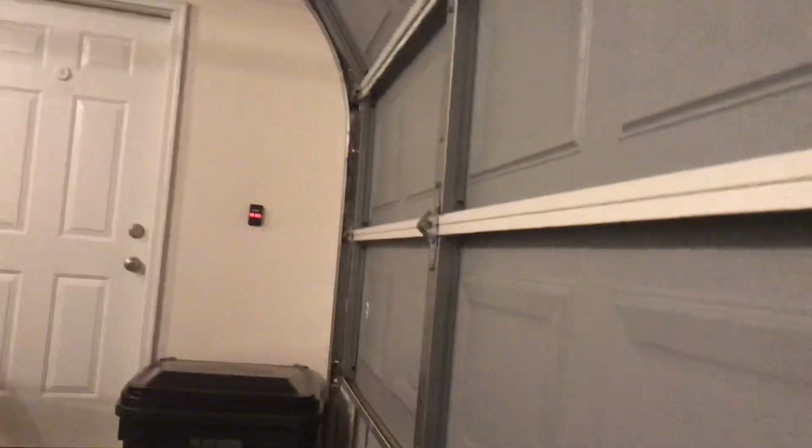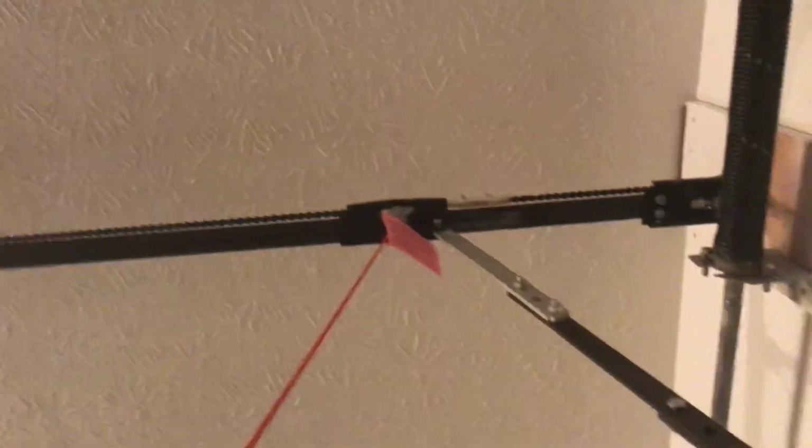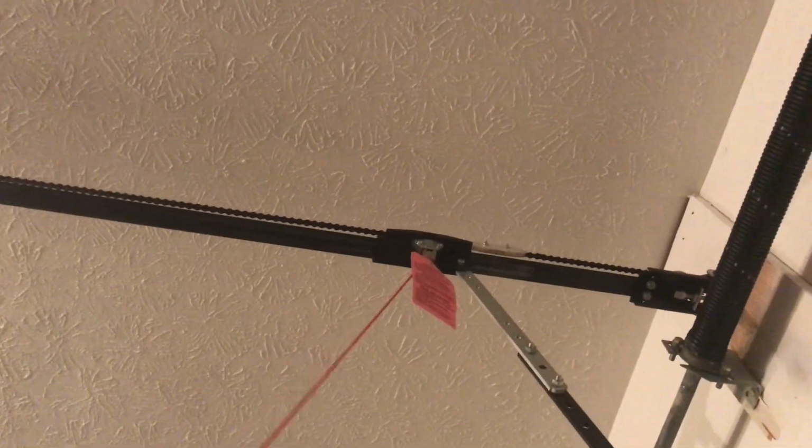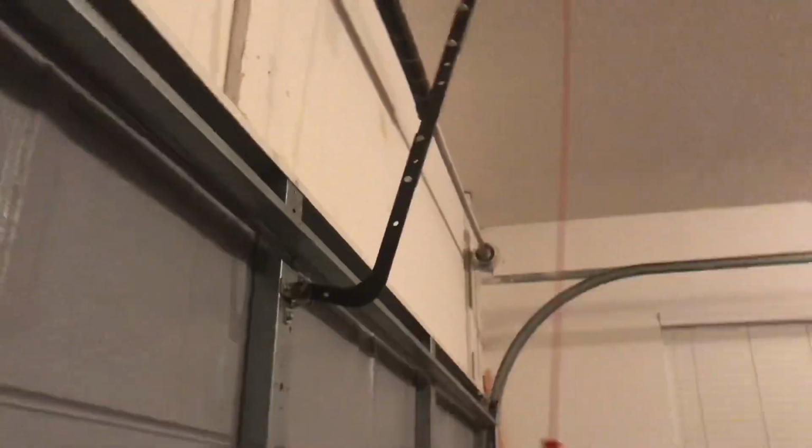You can see this door is fairly balanced. So to reconnect it, you just go over and hit the button. But if you want to have it disconnect so the motor doesn't reconnect it, you want to have it in this position or this position, so this trolley here doesn't allow the other trolley. But if you want to get it back to the reconnected position, just put it in that middle position. So enough talk. Let's run this motor.